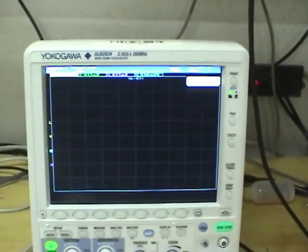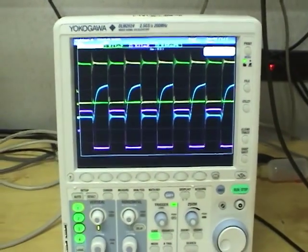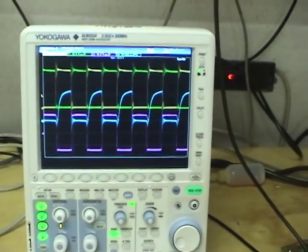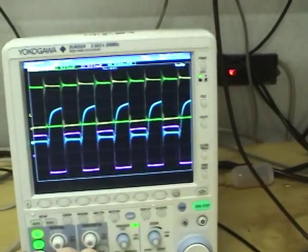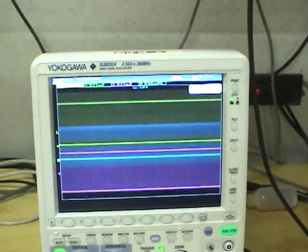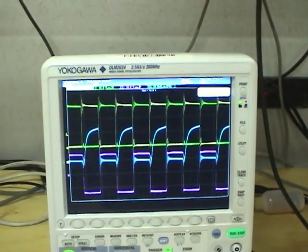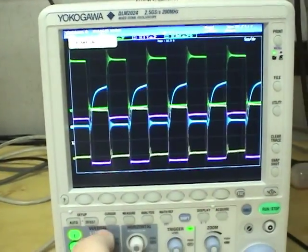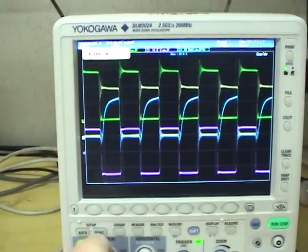Let's look at the controls. One thing that annoys me is that often when you change a control after it's been sitting for a while, it goes through some sort of auto-calibration routine — although you can turn that off if you don't like it. The controls are decently responsive, better than low-end Tektronix stuff, although slower than the Agilent 6000. When you move stuff in vertical, it snaps to grid lines unless you move it slowly, which is quite a nice feature.